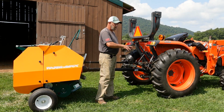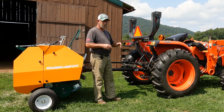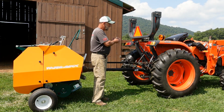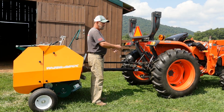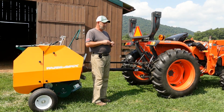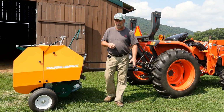And let me say this, even with the tractor, when I had it up on the 3-point and I felt uneasy, I have ballast in my tires, so that really helps. If you're baling hay and you don't have ballast in your tires, especially if you're on a little bit of a slope, I would highly suggest putting ballast in your tires. We also have our wheels and tires outset as far as they'll go, which is fantastic. When I bought this tractor, they were inset, a lot narrower, and we switched those out to the outset, and it was unreal how much better the stability of this tractor was on a slope once we outset these wheels and tires. It helped tremendously, and then the ballast in the tires helped very much.